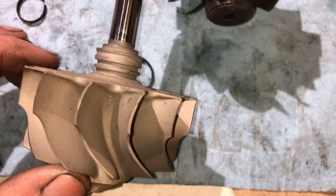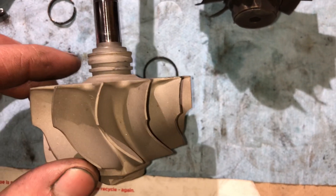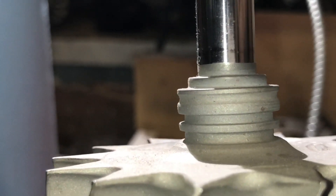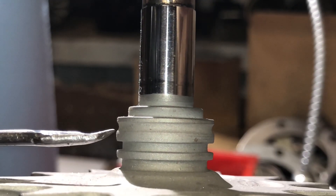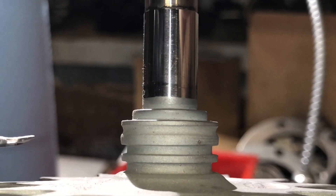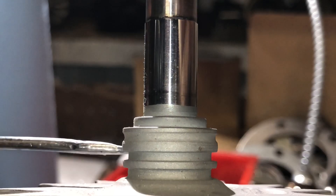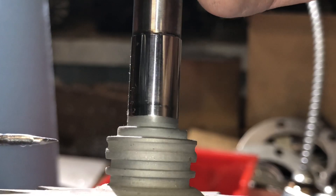This particular shaft isn't any good — not from wearing out the piston ring, but because the shaft is a little bit rounded on the edge. This shaft has wear so it should be thrown away and replaced. Looking at this area, you can see this corner is rounded — watch as I turn it, it'll square up a little bit — and it's just rounded in this area, so I'd recommend throwing this one out.